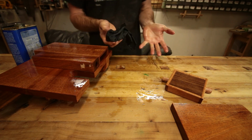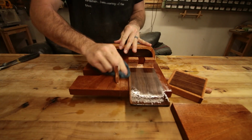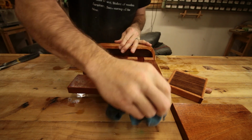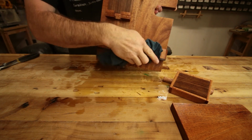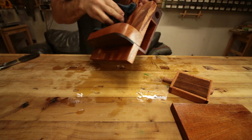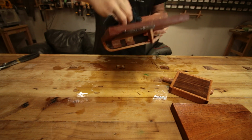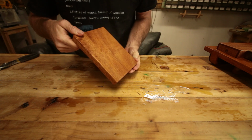Ugh. And then once you've thoroughly made a mess, go ahead and just wipe off all the excess linseed oil, and this is a good chance to buff all of the finish in on the top of the wood. You can feel free to leave it on there for a little bit longer if you want. I usually buff it off after about 5 or 10 minutes. So this is probably the best shot you're gonna get of the mahogany with the linseed oil on it.